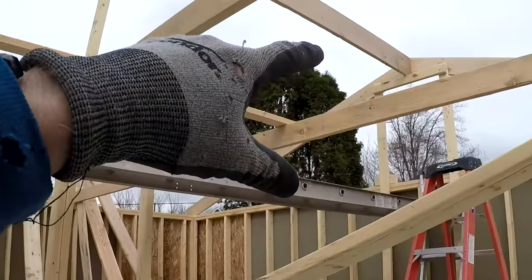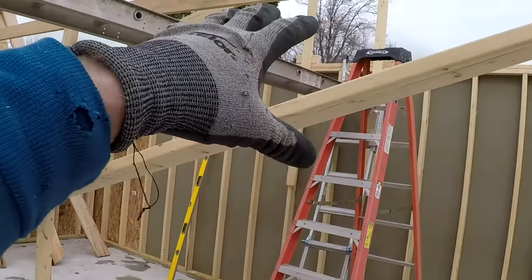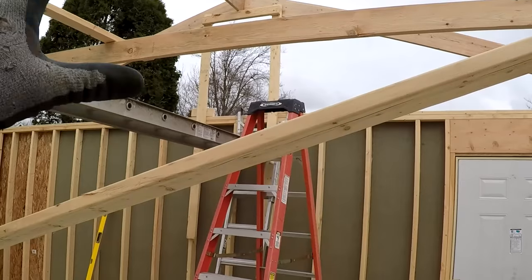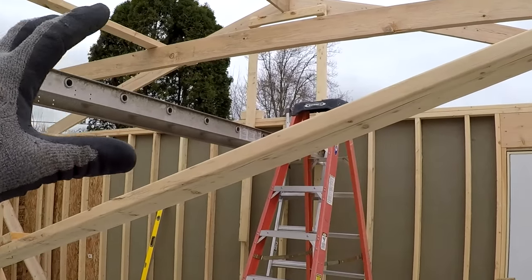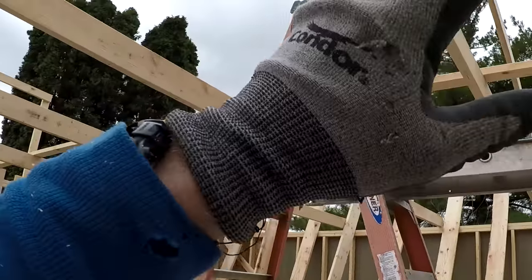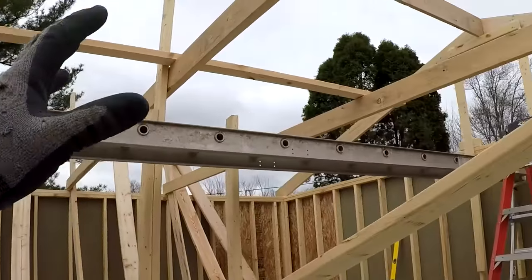But we're good. We're anchored up top. We get anchored down below, and then I think I'm gonna go ahead, get a ridge prop in here, and angle brace on, and have this completely solid, because we're braced down to the ground out there before I set my 16-foot section of ridge. Then it should start going together.